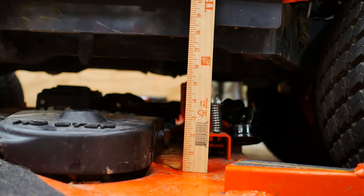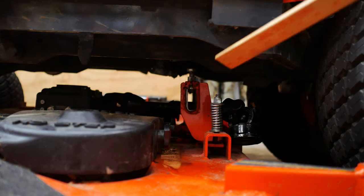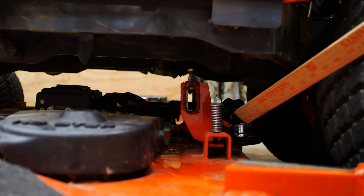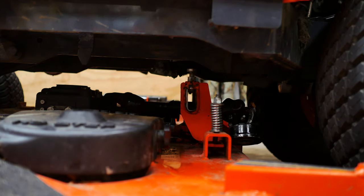I set the camera down at this angle because I want you to see that with the tractor sitting flat on the concrete floor, you really only have about seven and a half to eight inches of room to get inside there and work. That's just not enough room, especially when you have to do most of your work down by the back of this bracket and also to try to make that coupler work. So we're going to pull this back, put the tractor up on the 4x4, and you'll get to see what it looks like with the rear end lifted up.